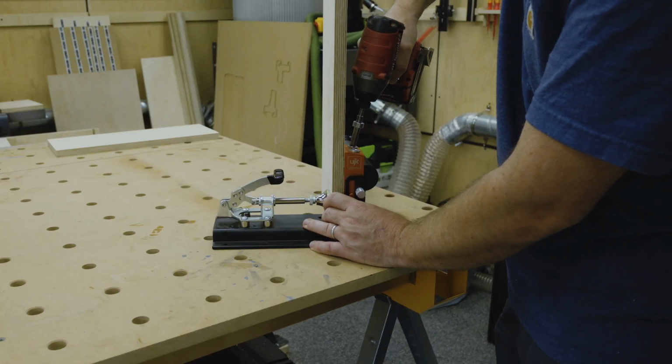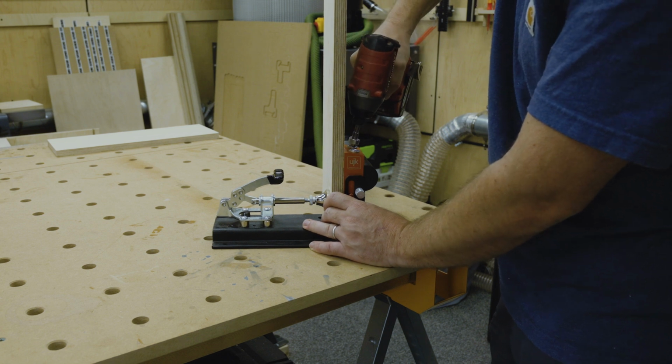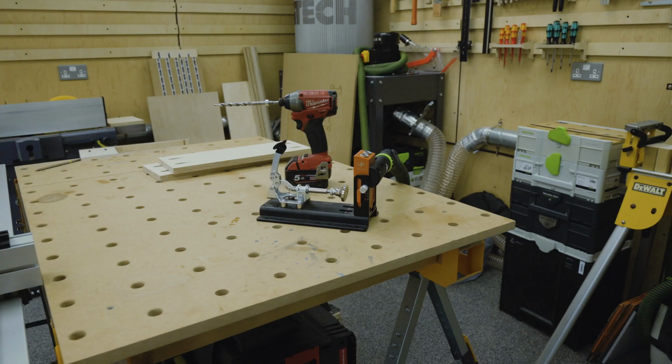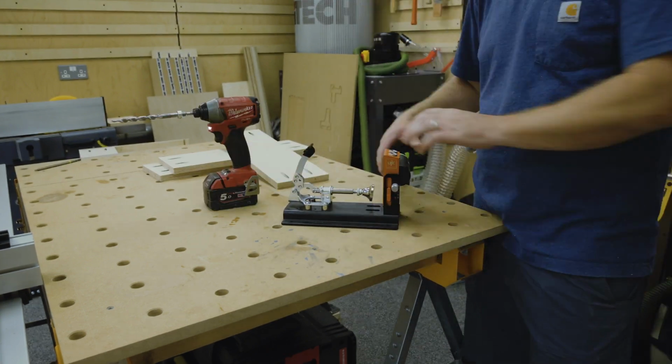Two pre-assembly tasks remain. First being to drill pocket holes into our 4 stretcher support pieces, where you will want to make sure that your drill bit stop collar is tight so you don't blow all the way through the board like I did on the first try.